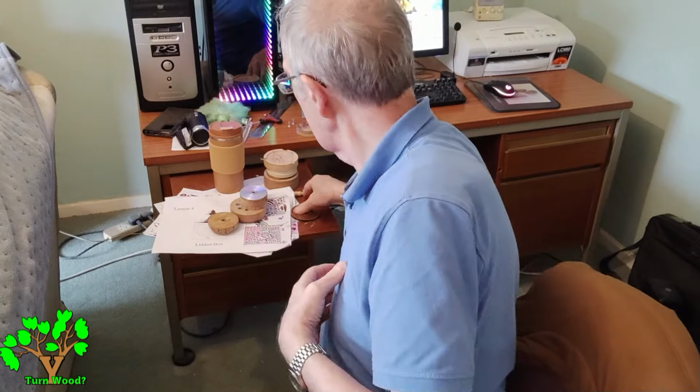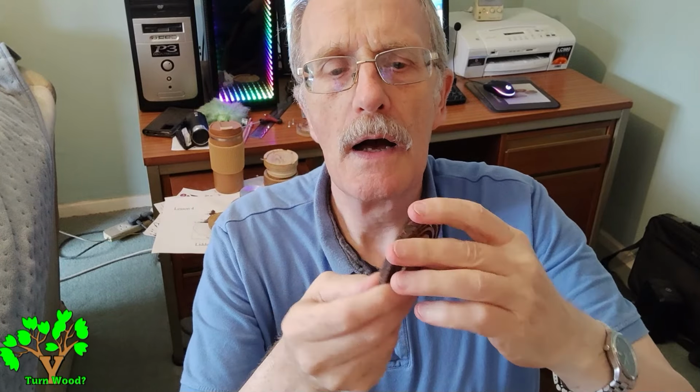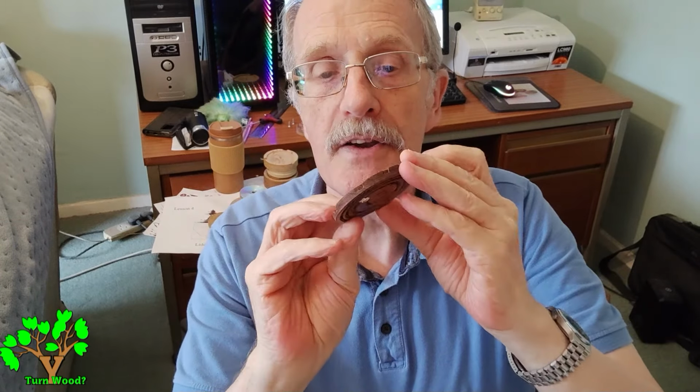Now what I've temporarily done, which you'll see in the video, instead of using double-sided tape, I've used ordinary masking tape, well, blue masking tape, and used super glue. And that seems to have worked, particularly when I'm doing grooves in both sides, at the back and the front. You've got intermittent cutting there, where you've got eccentricities, and in the back that's concentric circles, and you create a mesh, which is quite attractive.